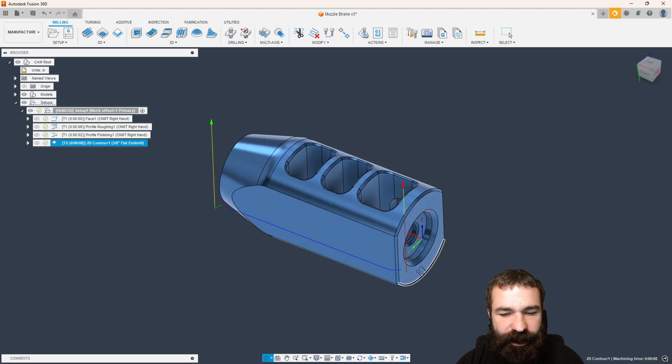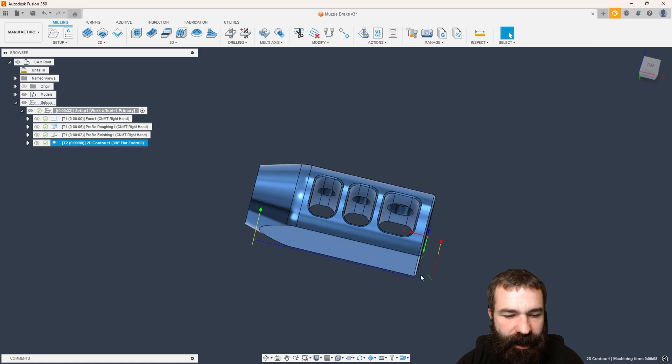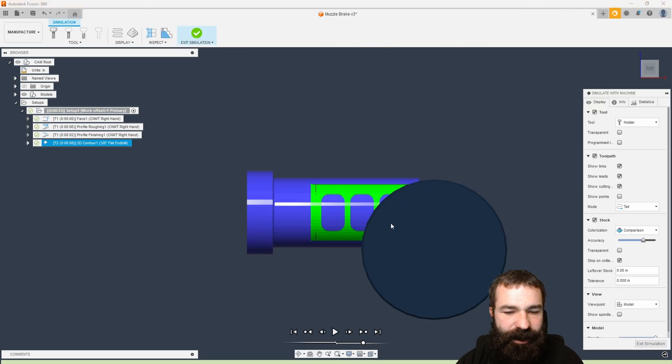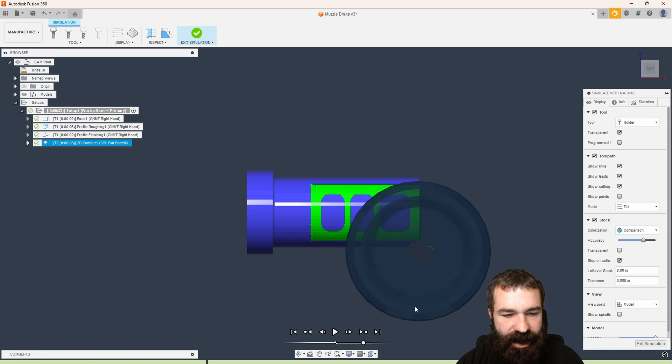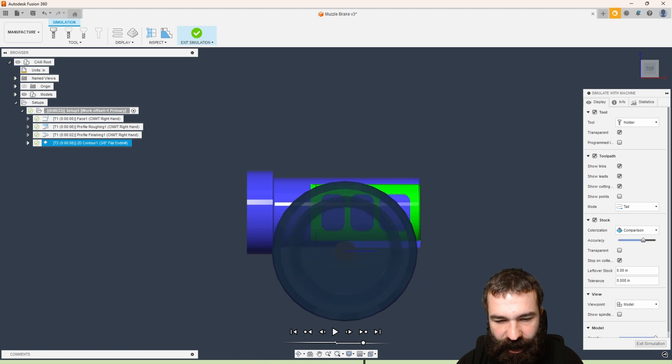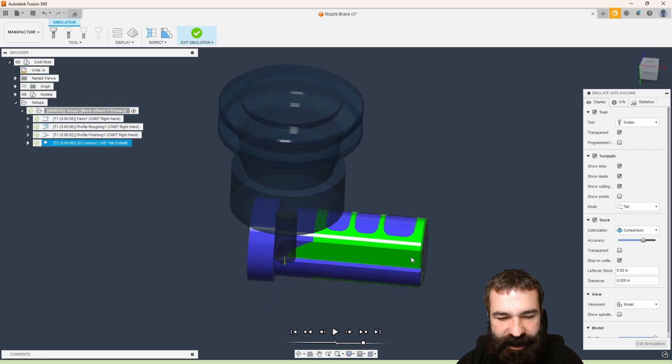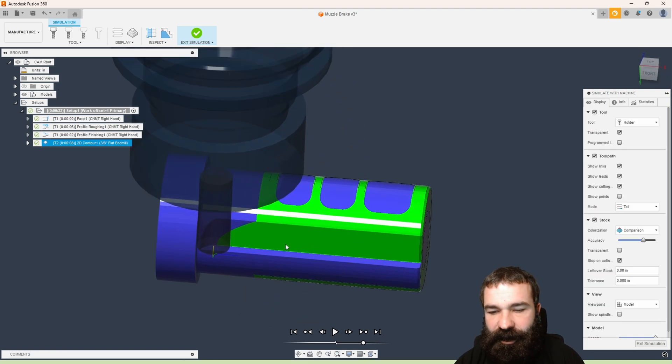I'm actually liking that. The only thing I don't like is that we're starting right on the edge of this part and coming right off the end — it gives it a little extra stress. If I go ahead and simulate this to see if we can get a collision, get our tool a little more transparent. As we're starting off that part, we are coming in. This is just a finishing pass — don't get super caught up in how we're approaching that stock right now. We're just making sure we're making it down that face and cleaning up the edge of our surface. So I'm going to give that a little tangential extension.